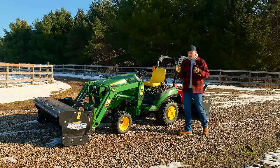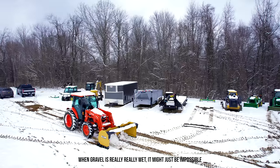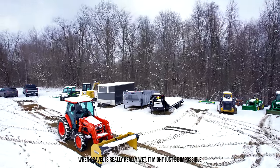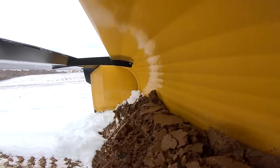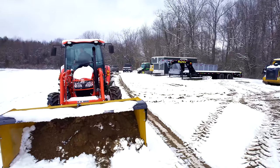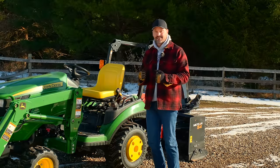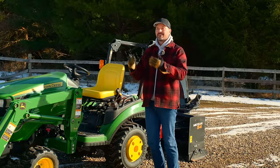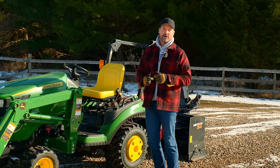When gravel is soft, your equipment is going to want to sink down a bit into the stone itself or into the dirt or mud. So you need to account for that — that's why you want to raise it maybe as high as it can go, which could be an inch or more above the plowing surface. And then the great thing is that once you do get those hard freezes and everything's firming up and not going to sink down, then you can adjust those skid shoes and skid runners to lower your blade down so you don't leave as big of a swath of snow on the ground.